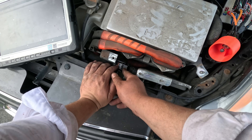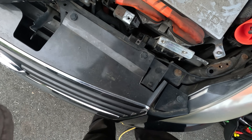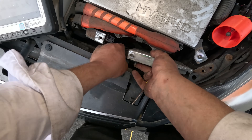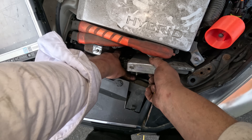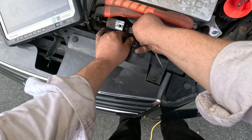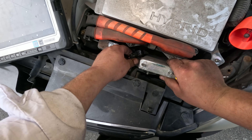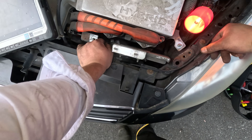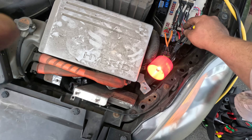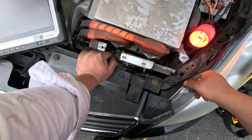So the brown connector is not the one with the blue wire. Let me unplug this one - and with it unplugged we have our short back. So it's not this white and blue wire causing the short. The computer must be powering something else up that's creating a short, which is blowing the fuse supplying the computer.